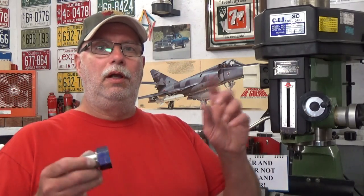The hole I'm producing here is for a 1-inch 14 class 2B thread. Not 2B or not 2B, class 2B, B meaning inside thread. What we cut the other day was a class 2A. This is 2B. A lot of people would just get the tap drill chart out and bore the hole out to the tap drill size, and that is a big mistake. If you have a turned thread, there are specific diameters to respect that aren't the same as for a tapped thread. If somebody asks for a turned thread and not a tapped thread, you're going to have to get the proper minor diameter.